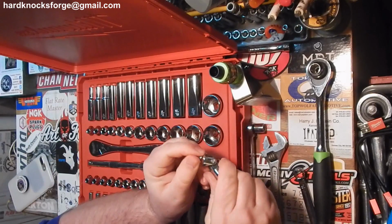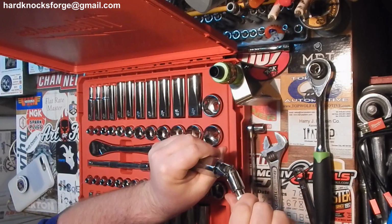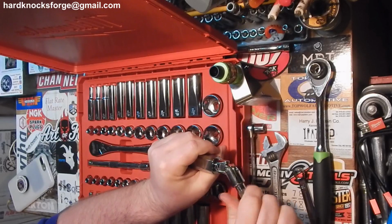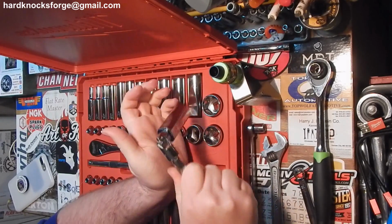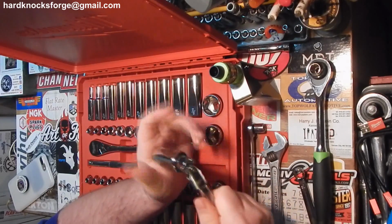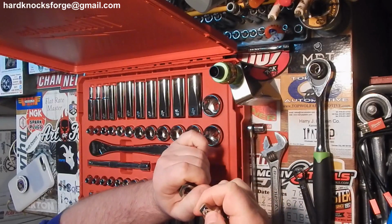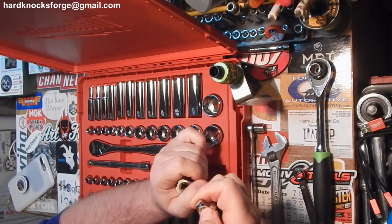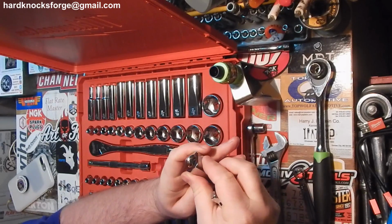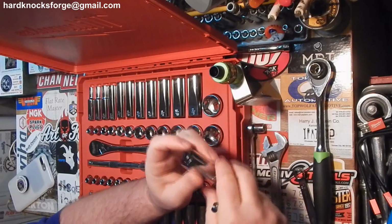Swivel doesn't really look like anything too special. It does work. It does have positive lock on there. Of course these are new, so test that detent out over time. See just how good. I mean, that's pretty stiff spring. And they do have pretty deep detents in there to catch it. All the detents are on all 4 sides.